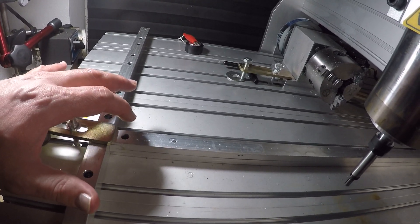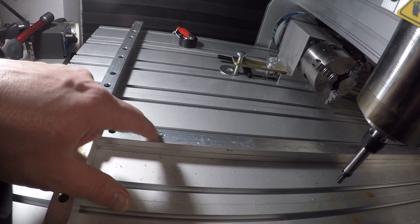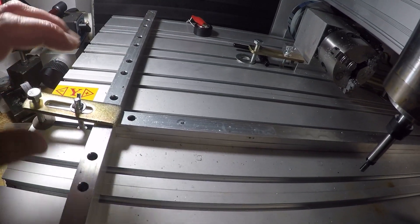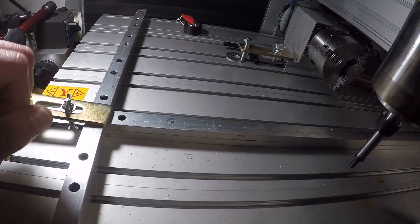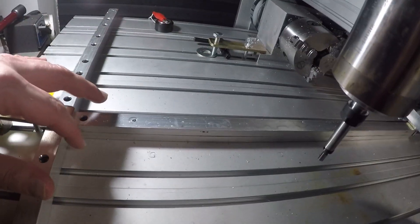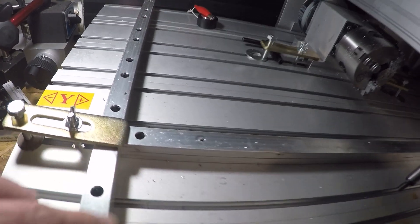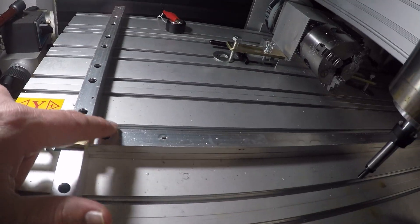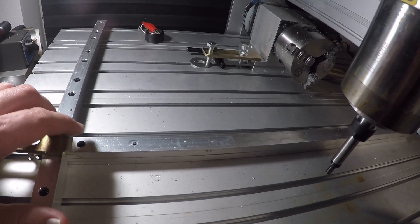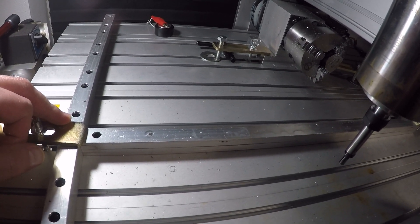So this one's going to be 2D boring. I already tried that and it didn't seem to know about the top hole — it just tried to punch straight through to the bottom hole and totally boogered everything. The machine jumped steps. Going back and trying again, I set the order to do top first and then bottom. I also gave it more passes at a shallower depth, since the chips were getting stuck to the bit. See if all that together makes for a good run.